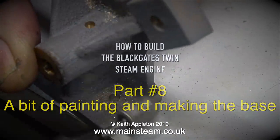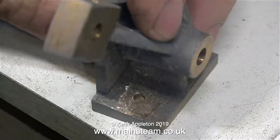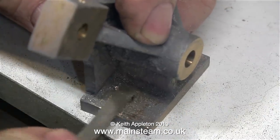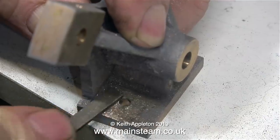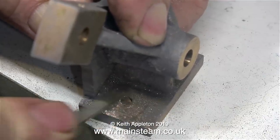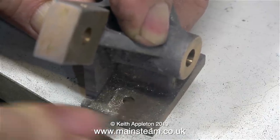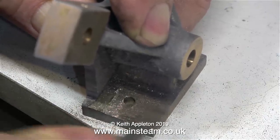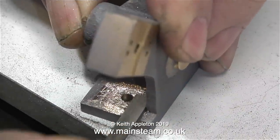What I'm doing at the moment is using a diamond burr to flatten off the top part of the engine base — not the base that I'm about to make. I also used a needle file and finally I got the base of the engine to be quite flat. Normally I would just machine a recess around the hole to make it perfectly flat, but because of the shape of the casting I can't do this, so I just thought a bit of hand work should do it okay.